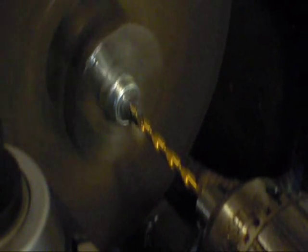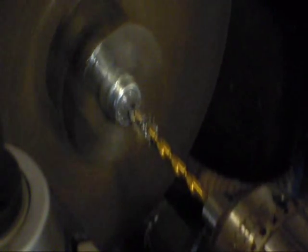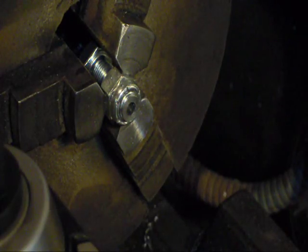Working backwards to double check — I'm at about an eighth inch now. It might be a chrome bolt too; if it is chrome it's going to be harder than hell. I can't remember if I got chrome or stainless. There's a quarter inch — all right, our bolt is all finished up. Just got to do three more of those for your spider, and then we'll find a little hunk of brass, measure it out and spin it.